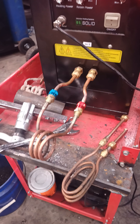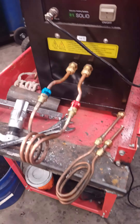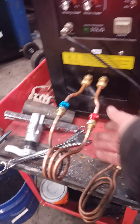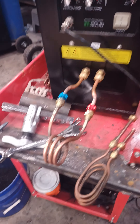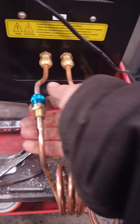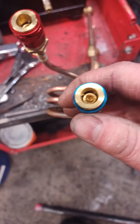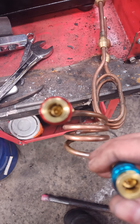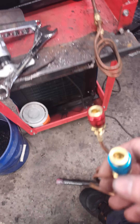This is one inch round bar. So far so good. And we're about 17 seconds. Right now we're just below critical temp — it looks brighter on the camera than it is. Right now we're in the critical temp range, transformation temperature. A little bit brighter. 42 seconds. I'm not seeing any performance issues right now from what it has in the past.